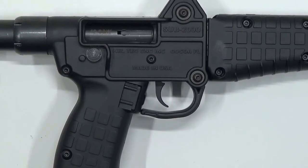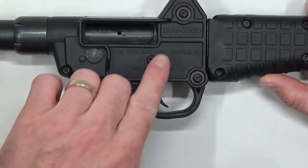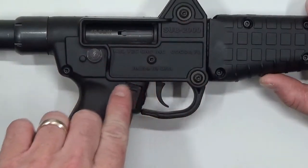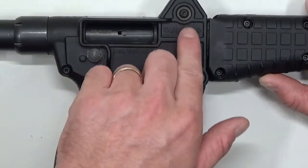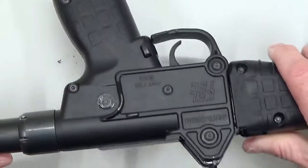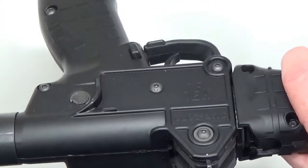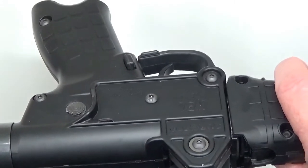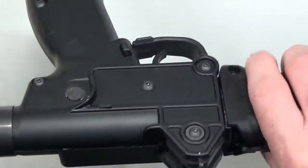Hey, I'm Carbode Brotherhood. Let's talk about the screws in your Kel-Tec Sub-2000 real quick. Take a look at mine right here. These here are black oxide coated 12.9 class aftermarket screws. These right here are the stock factory Kel-Tec plain alloy steel, no finishing, 10.9 class metric screws.